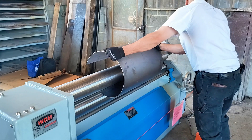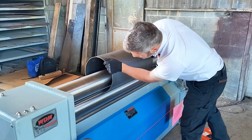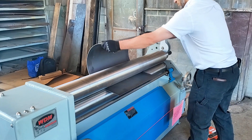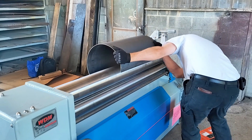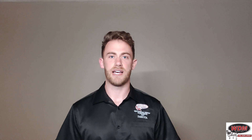One tip when re-rolling a piece: you can switch the leading and trailing edge, so the leading edge this time will be the trailing edge next time — this helps get a more concentric part. Also, do not let your metal come out the other end of the roll. Don't let it feed all the way through to where the rolls snap back together and make a popping sound. Keep an eye on your material and right before it goes out, stop rolling and lift the latch handle up to release the pressure. That will help the longevity of your bearings — it's really hard on the machine to let the rolls snap back together.